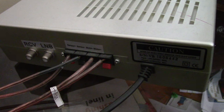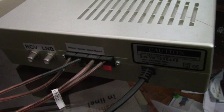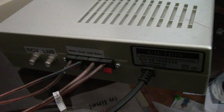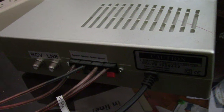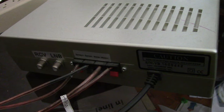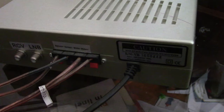That dish controller also has an LNB and receiver connection. If you want to hook your receiver up to this and have your receiver move your C-band dish, you can set it up in the receiver settings. The reason I don't use that is because the reed sensor is always going to be a little bit off, so it's never perfect — you'd have to manually adjust every time you move the dish. Also, your receiver can accidentally change channels and start moving your dish way out of position, so it's not my personal preference.